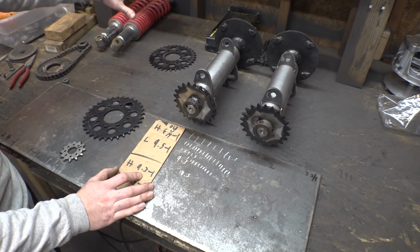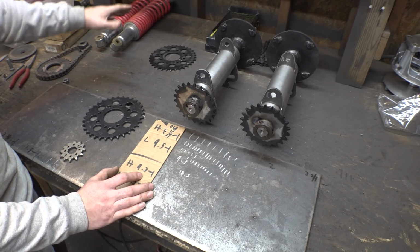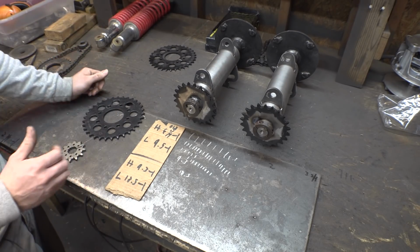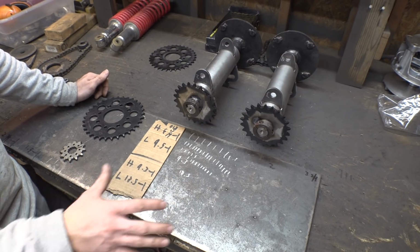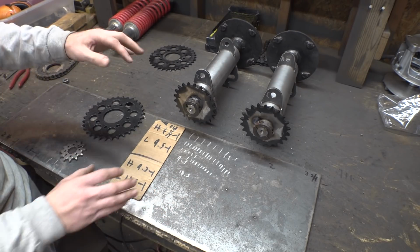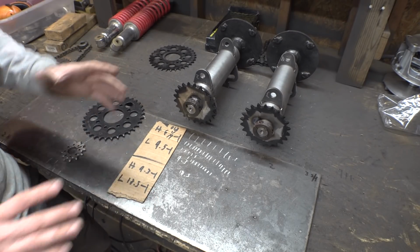We have the red 2-speed go-kart, which we've already messed with the gearing on that vehicle. We already dialed it in. Works great on that vehicle, and that has the same engine, same tire size, and similar size frames and all that kind of stuff with this vehicle. So all you have to do is calculate that gearing on the red 2-speed go-kart and try to match it for this go-kart.